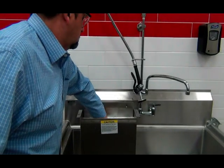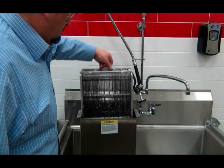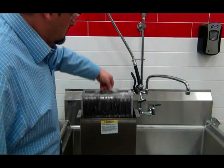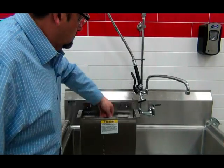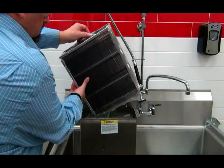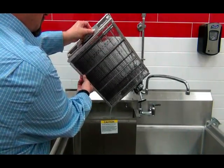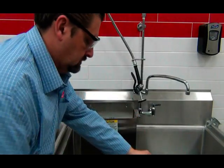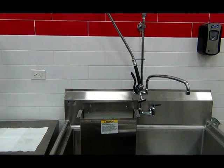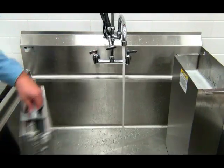After 30 minutes, lift the filter by the handle and jog the filter up and down fairly vigorously in the solution to help remove the grease residue. Carefully remove the EAC filter from the soak tank. Rinse the EAC filter in the sink using hot water.